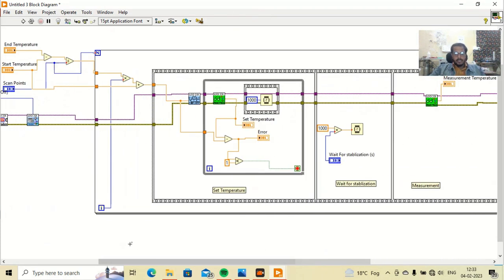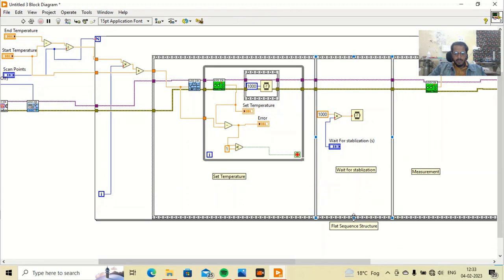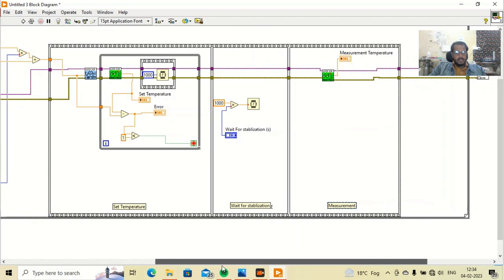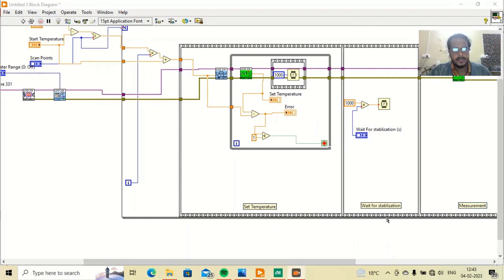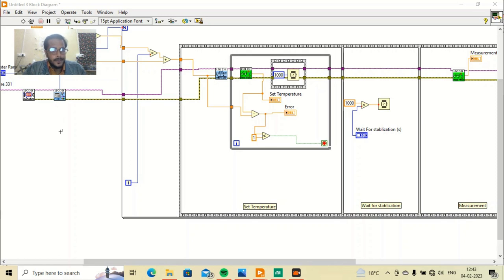So now we will add SMU measurement in this. We will use instrument drivers of the Keithley source meter unit for measurement of voltage, resistance and current. Let's see. Okay, so now we want to make a program for the Keithley SMU. This is the 2450 model, and it is better to use its instrument driver for better performance and accuracy.